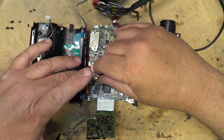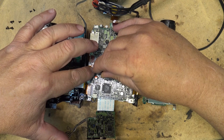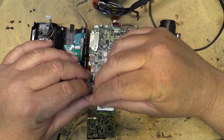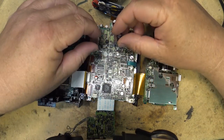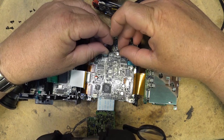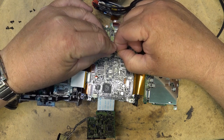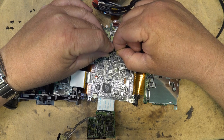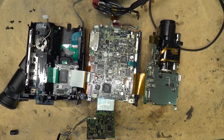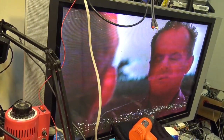What I'm doing here is bridging a couple of caps and just looking at the screen to see if there's any change, because the video right now is really dark and crushed — the sync is all crushed, that's why the picture is blanking. The first cap I tried didn't do anything. Let's try this one and see if we get any results. I'm looking at a freeze frame, looking for any change. Ah — that's the one. This one here. I'll show you what happens when I bridge this cap — watch what it does to the picture.